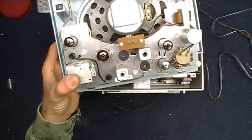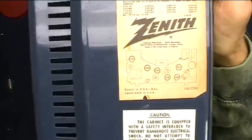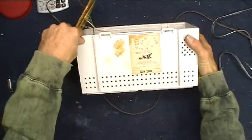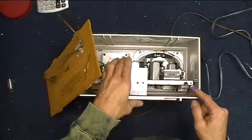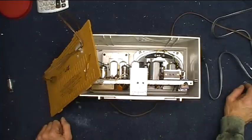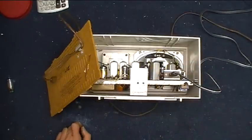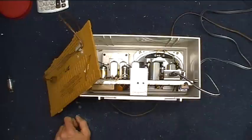Isn't that amazing — they actually fixed things instead of throwing them away. So I started swapping out tubes, and I knew what these tubes were by simply looking at the bottom of the radio, where there's a listing of every one of the tubes and their numbers. This radio, which is also a Zenith, has the same listing. As it turned out, right here — this tube, which is a 12BA6, a pentode for the RF-IF stage — has to do with the reception of radio signals. I replaced it and plugged it in, and that turned out to be the one that was bad. I haven't tried tuning any stations yet, but I did get static a minute ago when I tested it out.